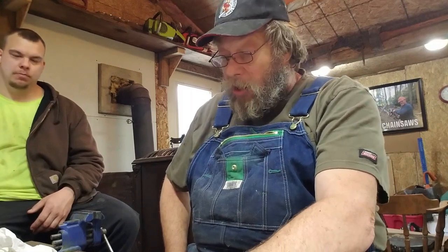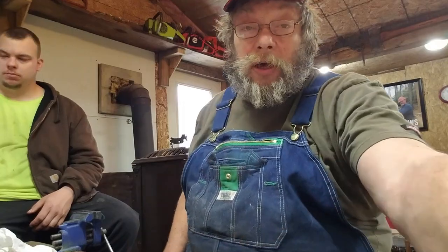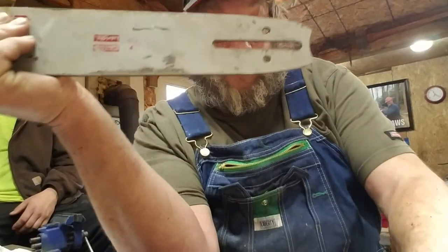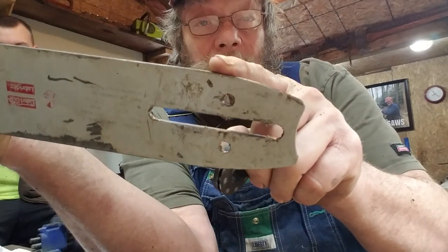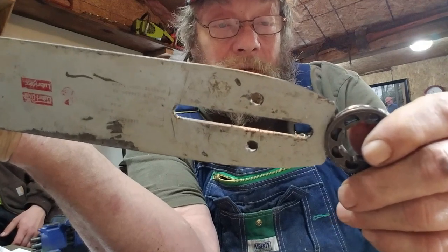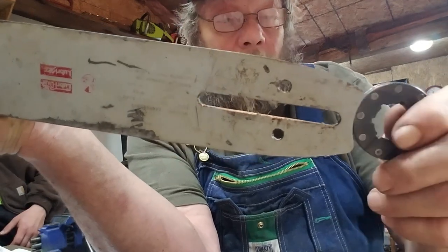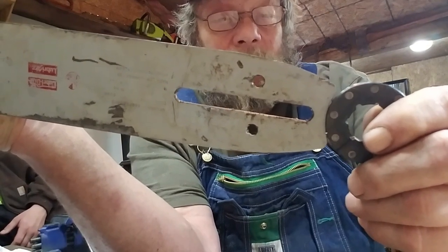Knowing that, the 9-tooth is a bad idea. I never tried one before. I got old Dave over here. There's old Dave. With a different bar profile, I probably could, but here's what I ran into. With the 9-tooth, the chain rides from here to here. It doesn't come in contact here. Now with an 8-tooth, it does. You can see that. 7-tooth more so. What this stupid sprocket did, Dave could pull that. Yeah, I can, no problem. But when I tried that, it was ridiculous.